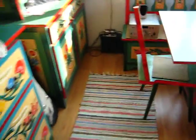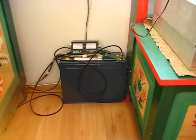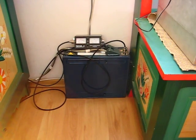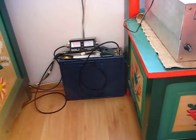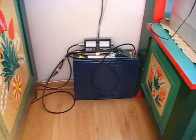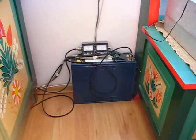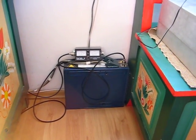I've tested it with that guy over there — this is an old military transceiver which is modified. I've put in some new quartz crystals so right now I have 10 channels on the 2 meter band, and it puts out 25 watts of radio power, so it's pretty good.